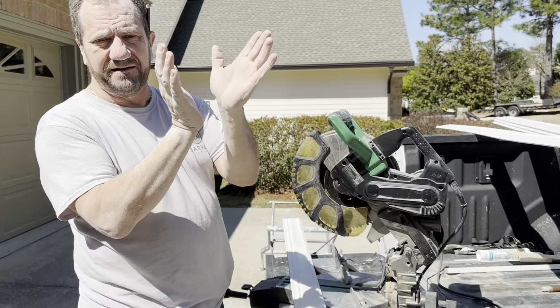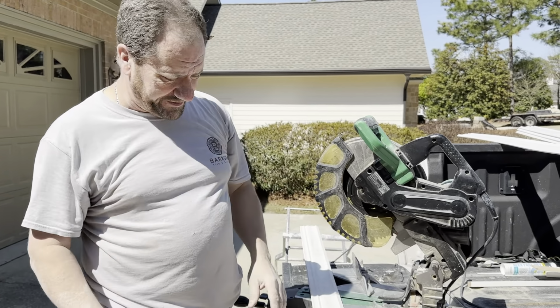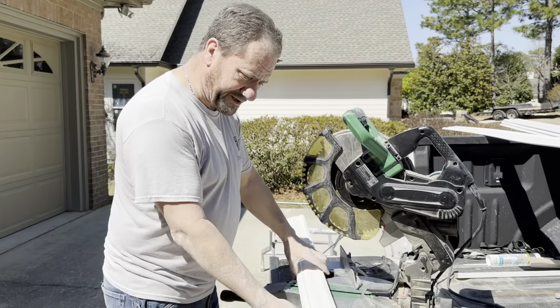Okay, so ideally this should be 22.5 put together to make a 45. It's not going to be. It's going to be a little different. But the easiest way to visualize is just cut a couple scrap pieces left over from another job, bring them in, put them up there. You can see exactly how much you have to tighten it, see how it fits the wall, that sort of thing. So the way I like to cut my crown, this is the bottom of the crown with that extra cove. I just like to put it against the bottom, hold it in there square, set my saw for 22.5.